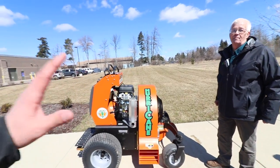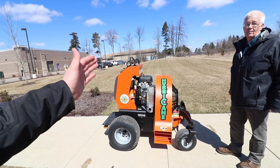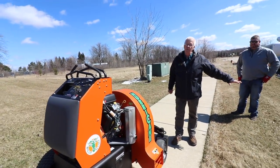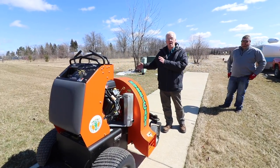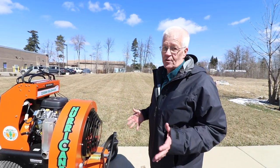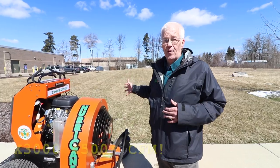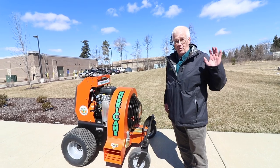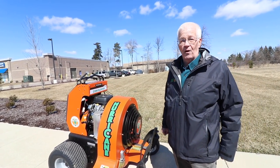This completes the Billy Goat family lineup. You have the walk-behind blowers and now the huge Stand-On Hurricane Blowers — all the way from the 6 horsepower small wheel blower up to the 13 horse and the 18 horse. Then we have two Stand-Ons: the X3000 and the Z3000. The X3000 is about 6500 CFM; the Z3000 is 8500 CFM. The Z3000 has a 35 horsepower engine, where the X has a 23 horsepower engine.